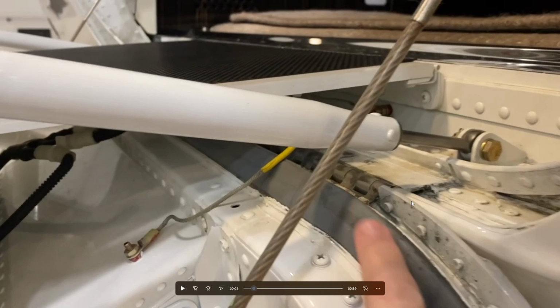So as I said, typically the walk around, the safety inspection, begins in the aircraft, and the next thing you're going to do is move to the outside. So what would have happened is you've gone in, you've checked the flight deck, done the safety inspection there, checked the circuit breakers, fire axe, and all those other things, checked the cabin, make sure that all the life vests, pull tabs are visible, and all the other things that we'll go through tomorrow.